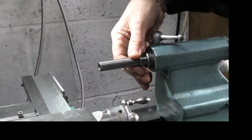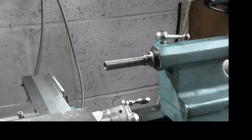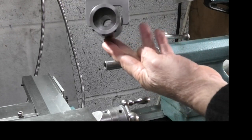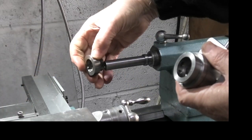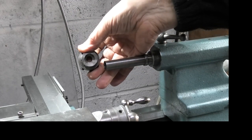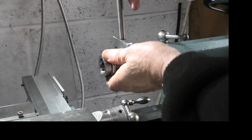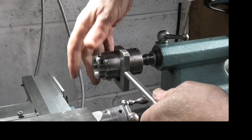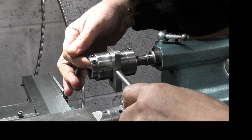This is my guide bar for the die holder so that goes into the tail stock. The die holder itself has two sides — this side for the larger dies, that side for smaller dies — and I also have an adapter so it can go in the large one or even smaller dies on each side. This was made from a Hemingway kit. The die goes in the end and this will rotate freely until I move the lever to the left or to the right. Then it locks and the die holds still.